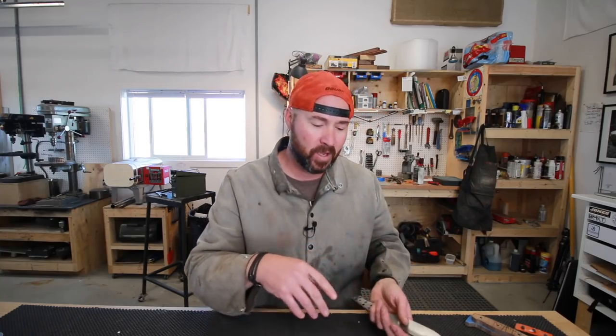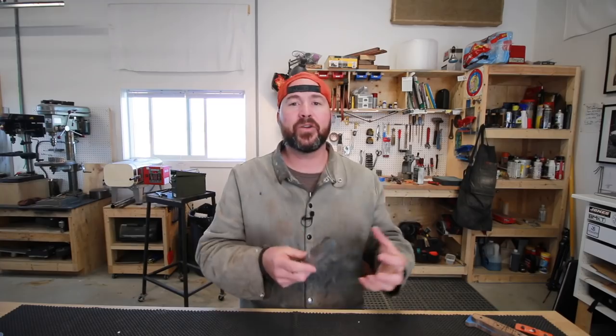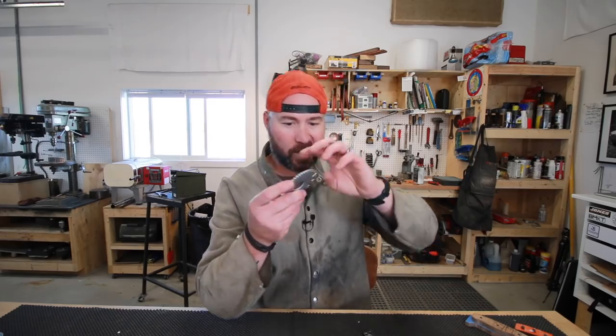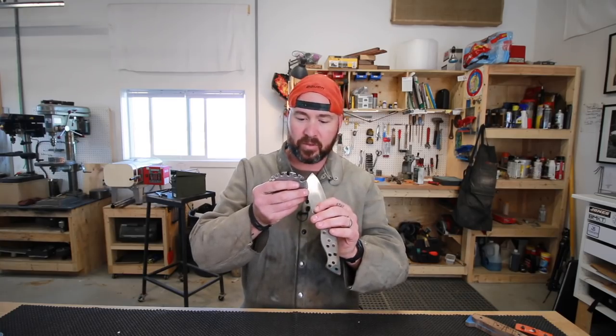They also do a great job giving a quick indication of edge thickness when you're grinding your knives. A question I get asked a lot is what thickness will you bring a knife to before heat treat or before sharpening. It kind of depends — it depends on what the knife is going to be used for. If it's for chopping, I'd obviously leave the edge thickness a little thicker with more of a secondary bevel. If it's a kitchen knife, you want to get it really thin. And then also, how much grinding am I doing pre- or post-heat treat? On one side we've got the gauge thickness, and on the other side we've got thousandths of an inch. It's really handy to leave these over by the grinder so as I'm grinding I can just use this as a reference — like, okay, I'm about 25 thou, I'd like to take a little bit more off before heat treat.